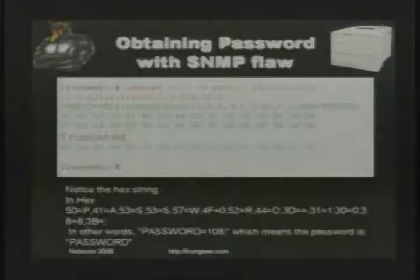Since it's Telnet, there are security problems — you could sniff the connection if you're on the same LAN and find the password. Very modern JetDirects have a web service with SSL. Another way to obtain the password: there's a bad vulnerability in older JetDirects where you can use snmpget from a Linux or BSD box — using SNMP version 1, the community string 'public', the printer's IP address, and a particular MIB. You get a hex string back; decode it to ASCII and what you get is the actual password of that JetDirect box. Most people don't change the community name from 'public'.